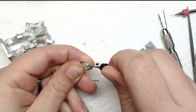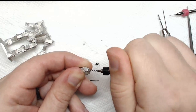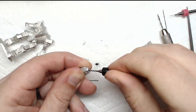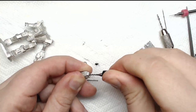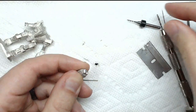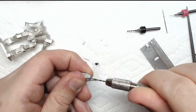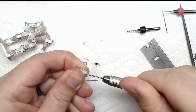These drill bits tend to be sharper, but you can't take as much bite because you're really just using finger friction to hold it. I have used a slow-speed screwdriver with an adjustable chuck for these, but if you get wobbly at all — especially with the thinner bits — you're going to snap off the bit inside the hole, and these hardened bits are nearly impossible to get out without taking a whole lot of material. I'll switch back to the pin vise because I get more leverage out of it.